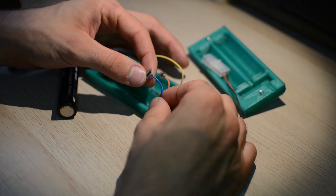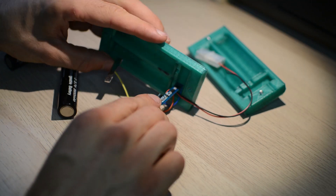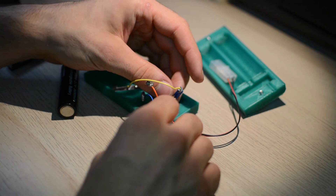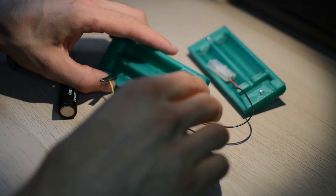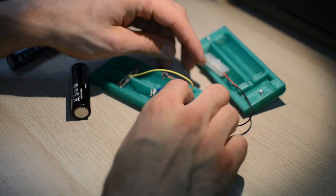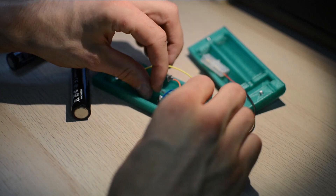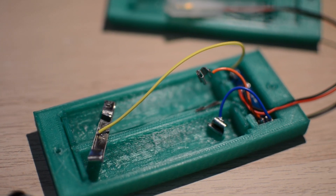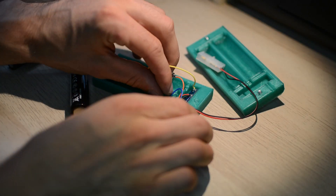Starting from the outside you can see a 3D printed case which is held together with two M3 bolts. Inside there's room for two 18650 battery cells which are connected together using some salvaged zinc or nickel strips, cut to size, all soldered together with some wires. The wires then lead to a generic battery protection and balanced charging circuit which I got off eBay. From there, wires protrude from the case where a standard Tamiya style connector is attached.